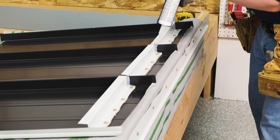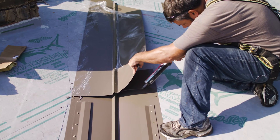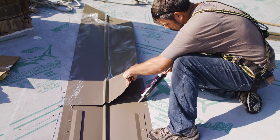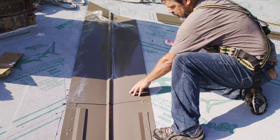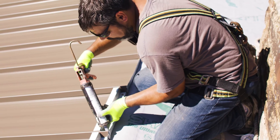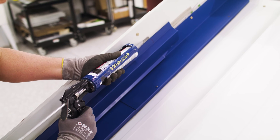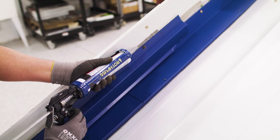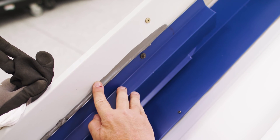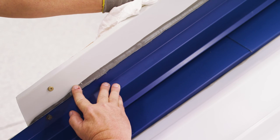Gun caulk is probably going to be used the most in terms of quantity on a metal roof. You're going to use it anywhere as a secondary precaution — I stress secondary precaution. It's used as a backup, not as a primary defense against water infiltration. You'll see sealant between panel seams to stop water siphoning, on the back sides of Z-closures cut tight against the metal legs with a bead of caulk behind as a secondary defense. It also appears visually on headwalls and sidewalls where you have reglets or surface mount counter flashings. In those situations, it's important to tool the sealant in or run a long bead to work out any air gaps so it creates a tight seal.